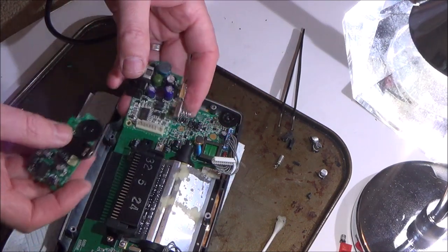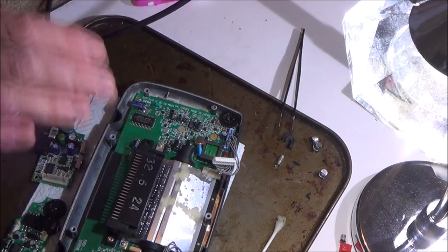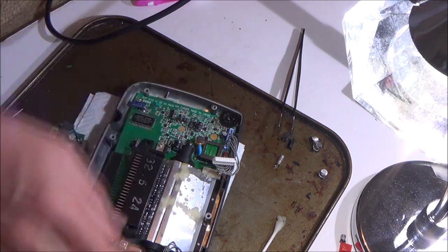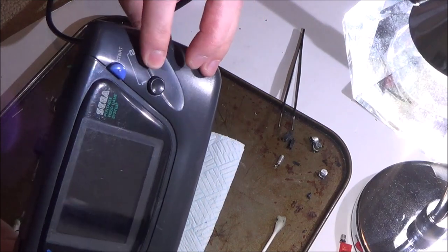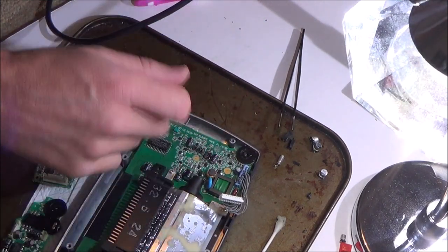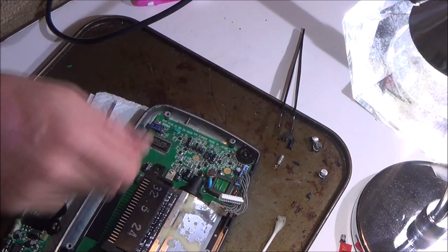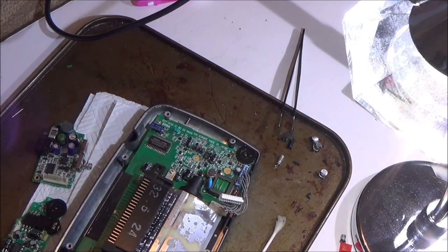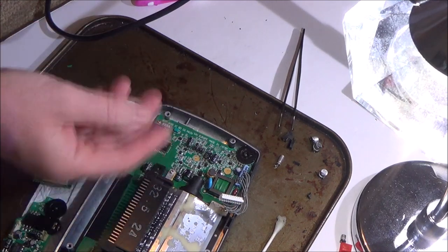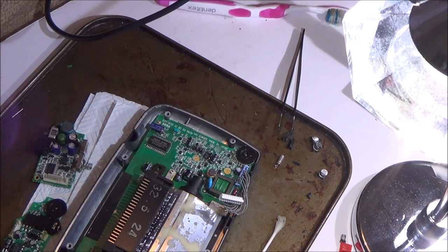and we'll see. There might be loads of other faults on this. I really haven't got a clue. Or I might be lucky, and that might have fixed it. I definitely need to double check that button, make sure that this button is working okay and nice and responsive. If not, I'll have to take it apart. And maybe I can tin it by just putting flux on and rubbing the soldering iron over it with just a tiny bit of solder all over it, just to give it a new shiny coating. I presume the solder will work just as well as the kind of copper coated or whatever it is on there at the moment, the shiny copper. So yeah, that's what I'm going to be doing now.